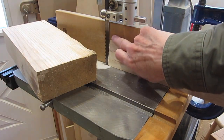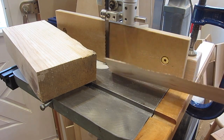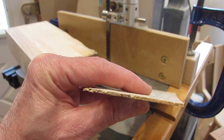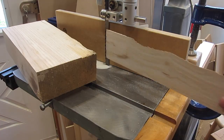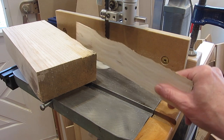It's not a special blade — it's not even a new blade, it's been used for a while, so it's a little dull. It's a three teeth per inch hook. You can see the uniform thickness there, because the fence is perpendicular to the table, and the table is perpendicular to the blade, giving good uniform thickness along the length. So no need to have a pivot block, like Craig sells as an accessory to compensate for drift.